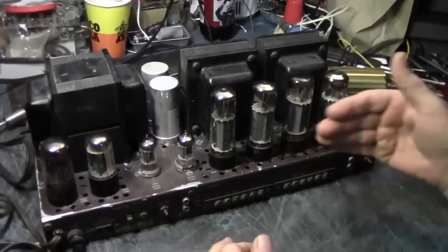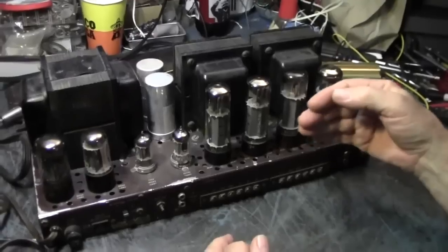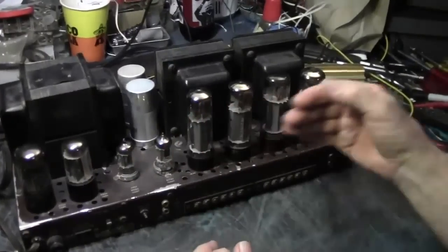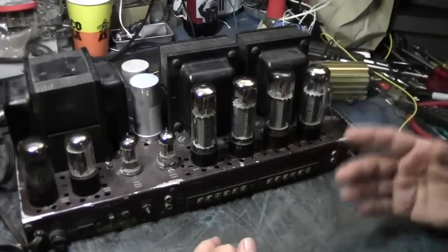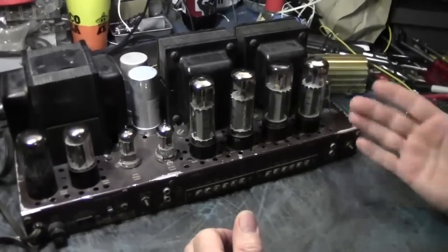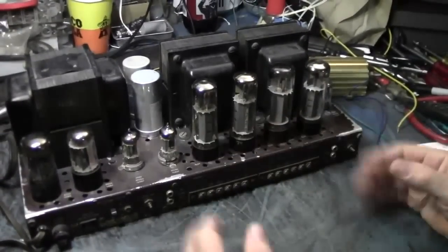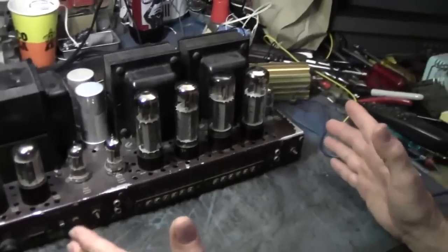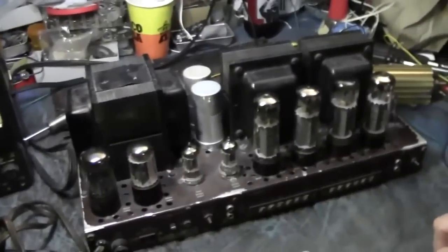But my fingers told me initially that, wait a minute, these are getting hot, these are not. Something's wrong. So I went to the place we would check the running current, which is the easiest place, the cathode, across the resistor to ground, compare this channel to that channel. Didn't have to do that because I found an open resistor and a shorted capacitor real quick. So I sort of jumped ahead one step. But that's amazing. That's why they pay me the big bucks.